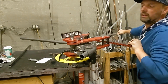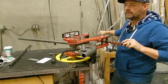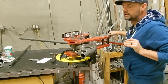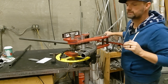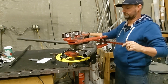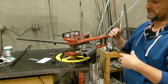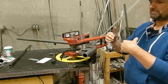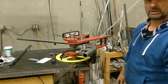So that means I need to go an extra few degrees past. The tube has a little bit of lubricant sprayed on it, so it wants to kind of spring back — you have to use your judgment here. Right there — I think we're good. We're at 90. And I can always take it out, put the square on it, and if it looks like we need a few more degrees, put it back in the machine and give it a couple more bends. It's hard to take bend out — it's way easier to put a little bit more bend in. So anyway, there's one tube. Let's do a couple more.